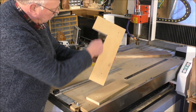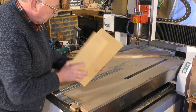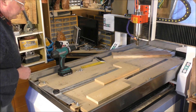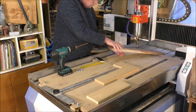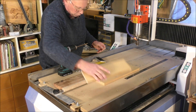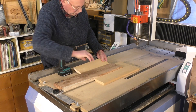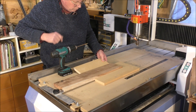All the jig is is a 90-degree cut-out, and the piece I've cut out is spare. What I'm going to do is line that up on the board — the waste sheet — nice and square and screw it down. Then position this material inside it, then put this spare piece solidly up against it so I can machine this side first, then take it out, turn it over, and know it's going to be in exactly the same alignment on the machine.